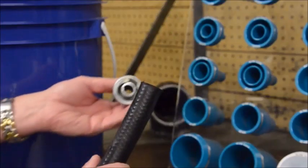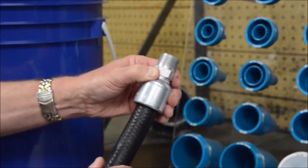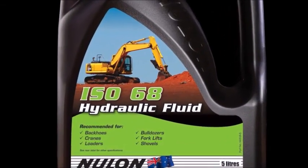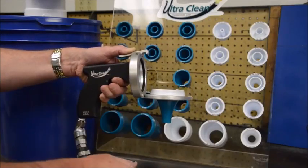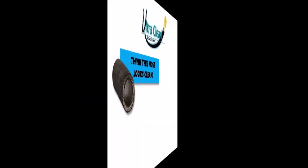When crimping or swaging the end connections onto the hose, do not lubricate the stem of the fitting with lubricants that are not compatible with your customer's hydraulic fluid — this would recontaminate the hose you're cleaning. Use lubricant sparingly and start above the end of the stem. A third and final projectile must be fired through the entire assembly to finish the cleaning procedure.